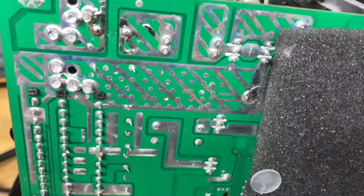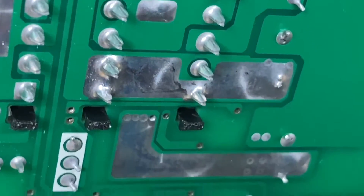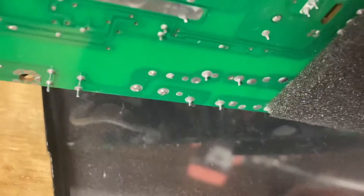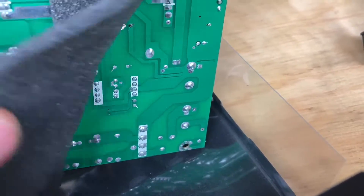The circuit board underneath has no chips. Traces look fairly good. Everything looks well soldered. The quality is not too bad. There is a layer of plastic insulating the bottom of the circuit board from the chassis, and also there is a piece of foam here for some reason - I haven't seen that in any other power supplies so it's a bit strange.